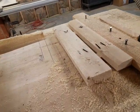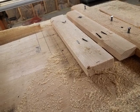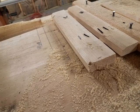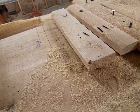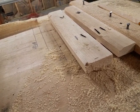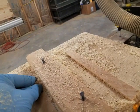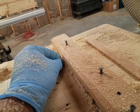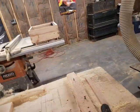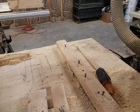You might ask, why not just clean it off? I would, over and over again, and I'd have friends here cutting boards and then supposedly cleaning. When you go to assemble your boxes later — at box number one hundred and fifty — you start noticing they aren't perfect anymore. People got lazy, myself included, and the sawdust would build up, so instead of your boxes being 16 and a quarter inches for the faces and 19 and seven-eighths for the sides, you'd start losing an eighth of an inch because of sawdust building up.